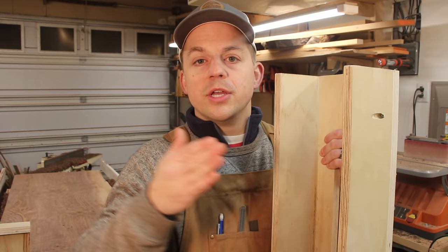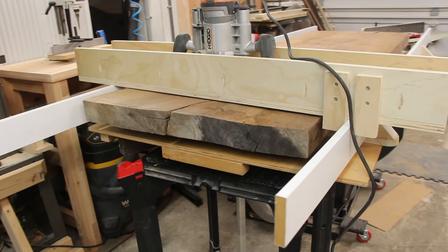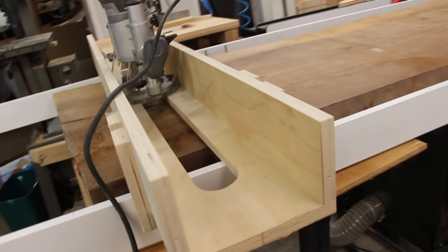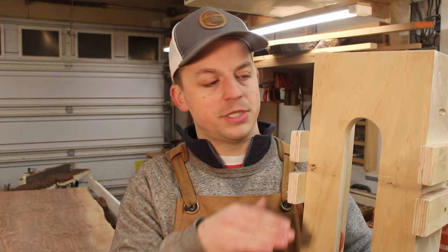One design option is to build a lip that hooks on the edge of your rails. Another one I've been experimenting with is basically turning my router sled into a table saw fence — it slides along one rail with guides and the other rail just supports it. This means when you do different sizes of boards you don't have to cut a brand new router sled every time. I can move these two guides anywhere I want, so whether my rails are two feet apart or three feet apart, this will work.